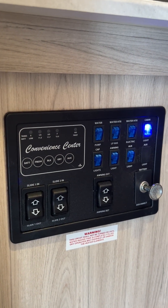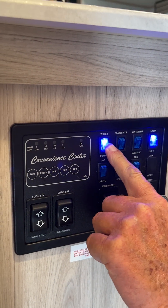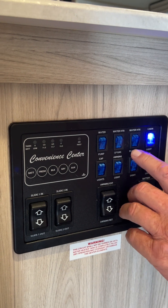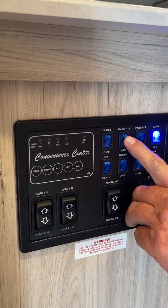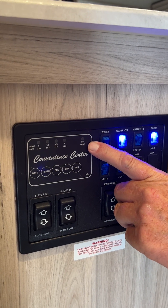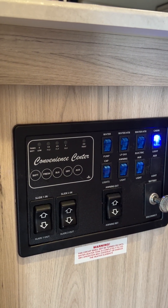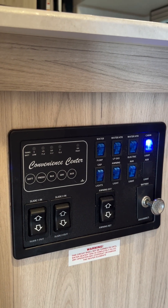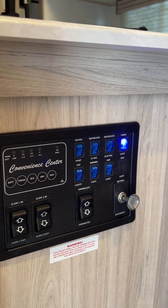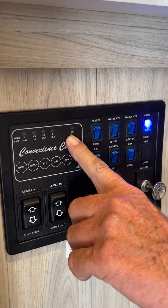Your first blue light on the top left-hand side turns your water pump on between the fresh water tank and the faucets. The second one is the gas side of the hot water heater. The blue light should come on, stand for about a minute, then the blue light goes off and it goes through three lighting processes to light on gas. For any reason it doesn't light, the little door side fault light will come back on.